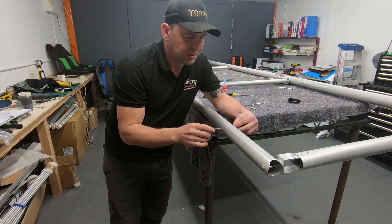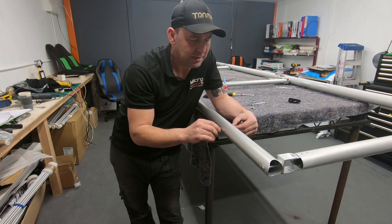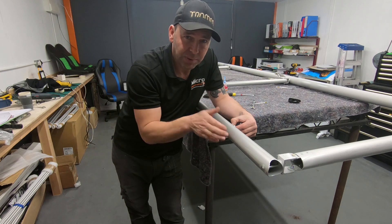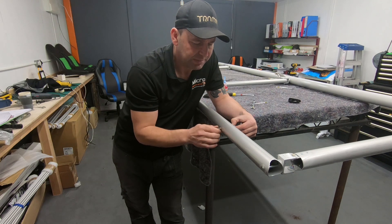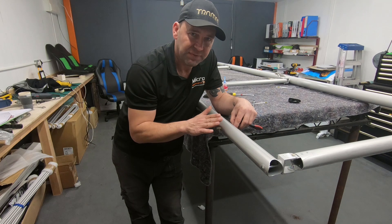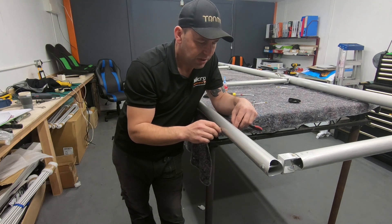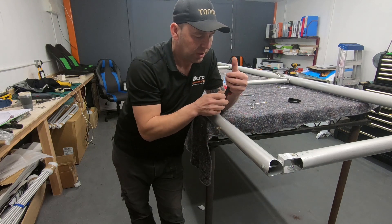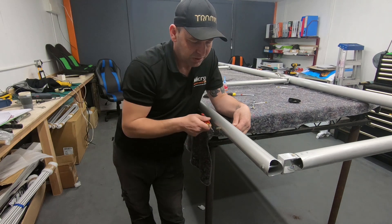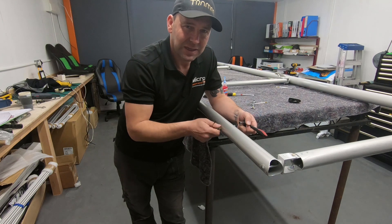Now we've run the plastic tape around the leading edge, the wing tip and the trailing edge. We can go ahead and fit the eye bolts. The last three we're not going to do — this one, this one, and this one we'll leave for the moment. This is what the ailerons fit to, so we're leaving these in mock-up so that when we fit the aileron, we can make sure the cables line up perfectly. You can't get to these nuts once the wing skin is on. So we leave those three and just fit the flap eye bolts. Don't forget your Loctite — and don't tighten these fully, because you will crush the tube. Use a small screwdriver just in there, tightening up so you still have some play.